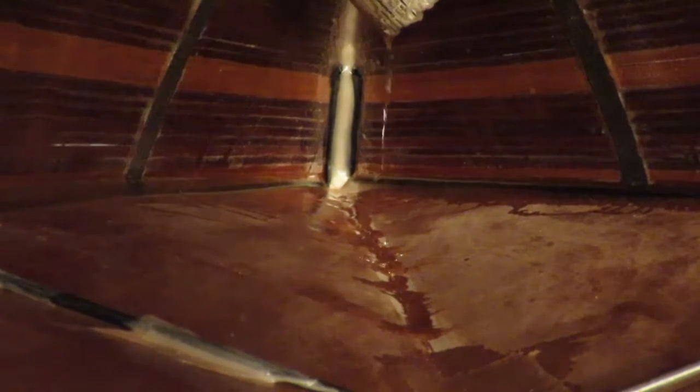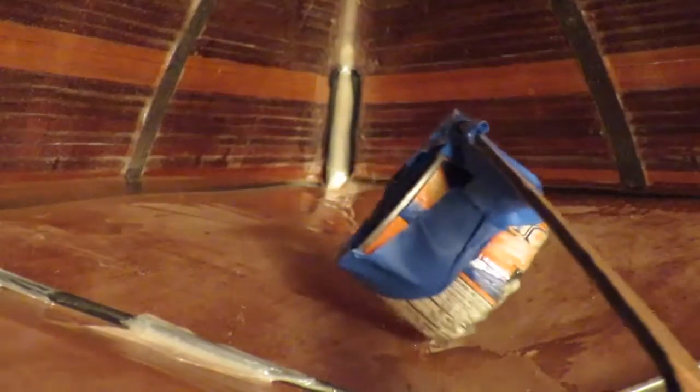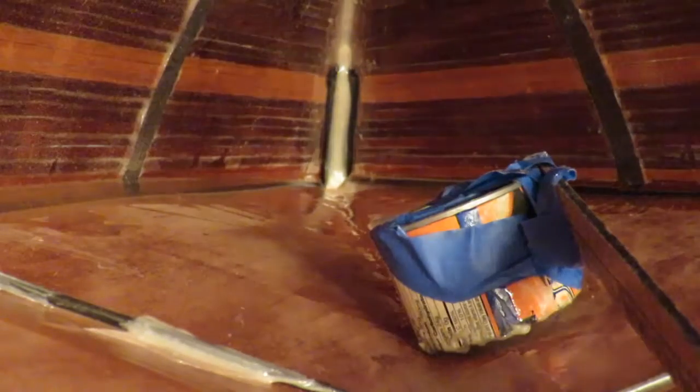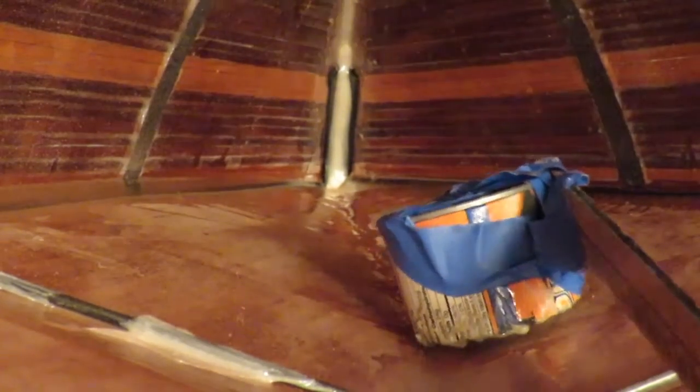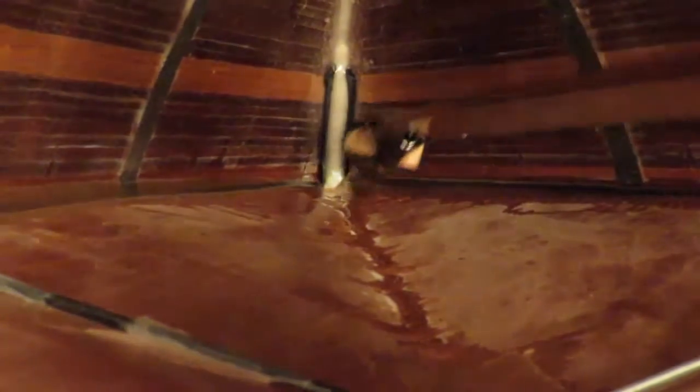And this was just what we had still left. We mixed up 6, remember, when we were doing the fiberglass cloth, and this is what's still left from that mixture. We were a little bit premature in hanging the fiberglass cloth on the brush, because we want the brush free to spread this resin. So we took the fiberglass cloth off.